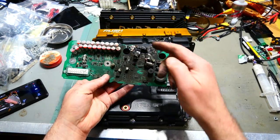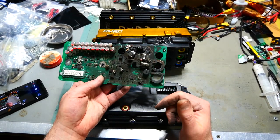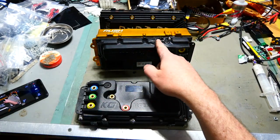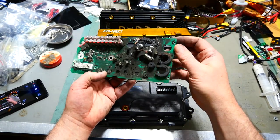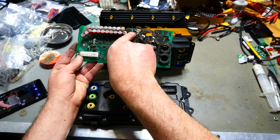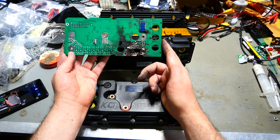As Chrissy calls them — 'dry state capacitors,' though they're just called thin film — all of those capacitors right there clearly exploded and caught on fire for some really insanely crazy reason. They all burnt themselves crisp toward the side of the cover. Look at all the crap on my hands from all the soot on the board — and that's top and bottom. Check out that hole right there — you're looking right through a scorched-through hole in the board. That's a hole through the board. Here's the bottom side.